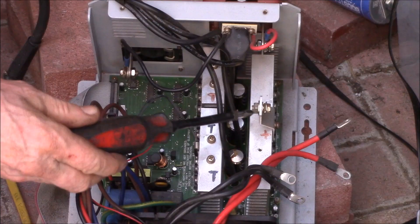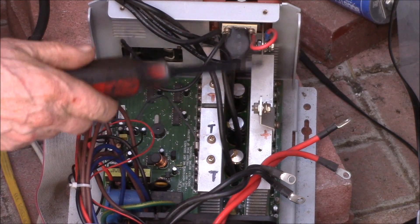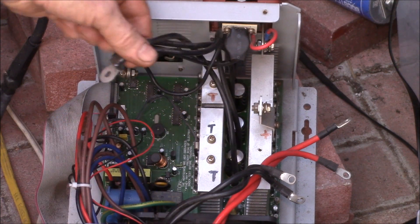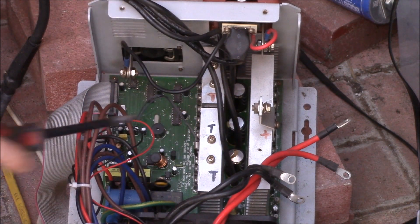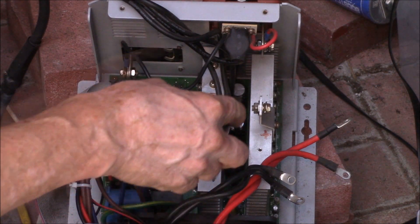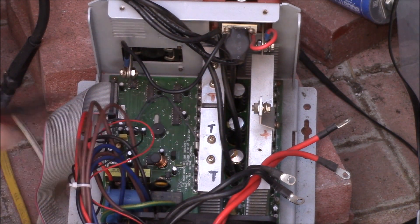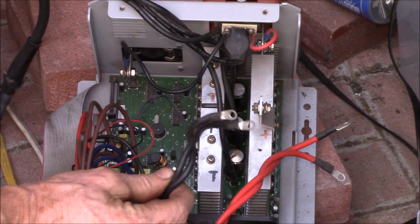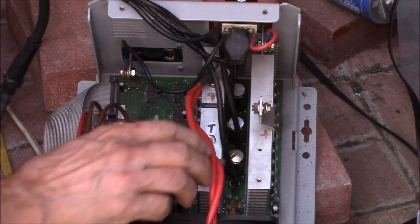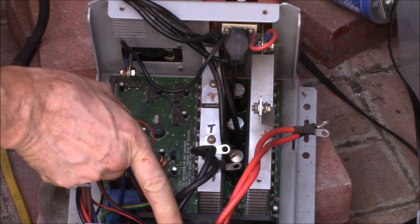There are three of them here. Your plus power is brought into this connection here, there's a 200 amp input fuse right there. These are your negative cables soldering down to the circuit board — this is your positive side of the H-bridge. The black wires are negative, and these are the two transformer connections: a pair of black wires and a pair of red wires that hook up to this heat sink, which is the input to the transformer right down here.